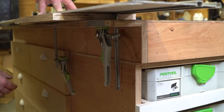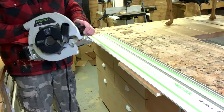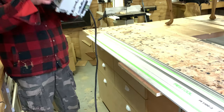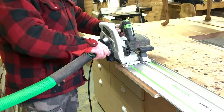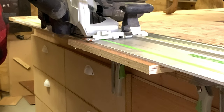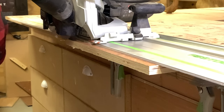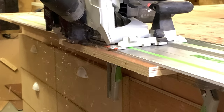I hope that makes sense, because it makes all the difference to your woodworking if you can understand that. In case you didn't get what I mean, if you take the workpiece, the piece of wood you're working with, to what you need to do whatever with, whether it's taking a drawer front to a cabinet, you should mark your lines using that piece of wood at that cabinet. Don't use a ruler, don't use a tape measure, just work with what is in front of you.